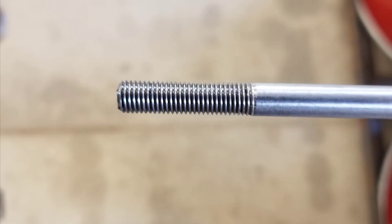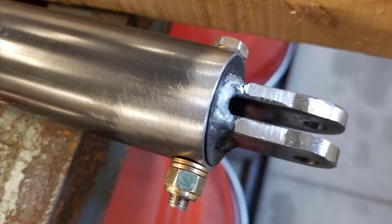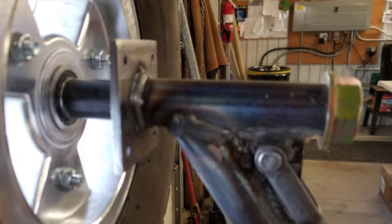We checked the stainless steel cross rods and found no elongation in the threaded area, and there was no binding in the threaded joint when we disassembled it for inspection. All attachment hardware and brackets were inspected for bending and cracking — none was found. The leg assembly was also checked for any bending or cracking, and none was found.